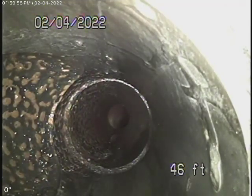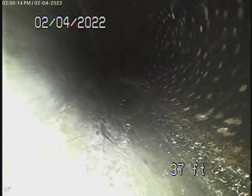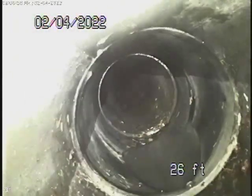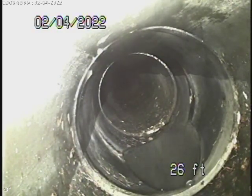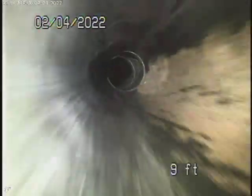We've located this outside in the driveway. It looks like there's a cover, but it's really like an area drain cover, so we're going to see if we can uncover it. In the meantime, we're going to continue our inspection. It's all ABS plastic coming back. Now we're coming into the garage where I think there's another possible spot — it might be a buried clean-out. That's possibly picking up the washing machine, not the toilet. That picks up the upstairs. All ABS plastic coming back, all in good condition. We'll stop the recording and see if we can continue from the outside.